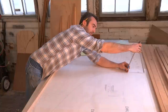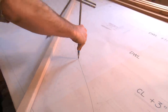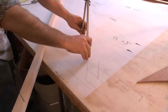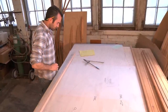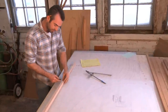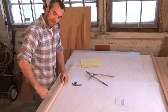I essentially count the number of times I place my divider: one, two, three, four, five, six, seven, plus three inches. I come to my frame, and because the S-boat has frame heads that are always one inch square and these frames are tapered, I find the point at which it's one inch, make my mark, and measure down from that point.